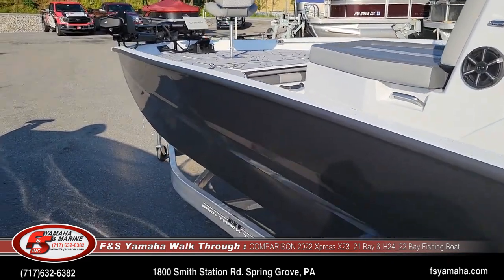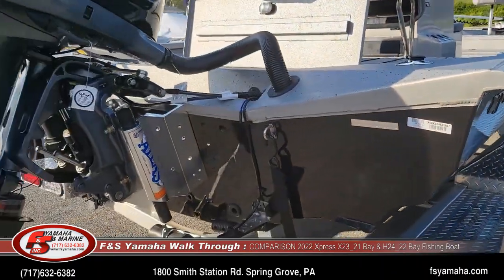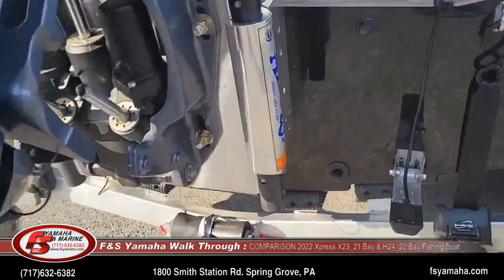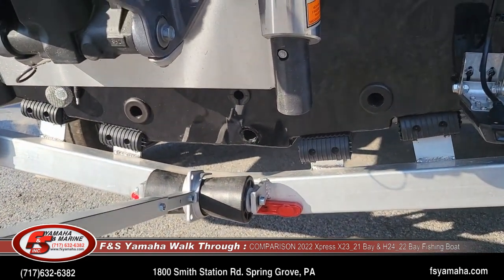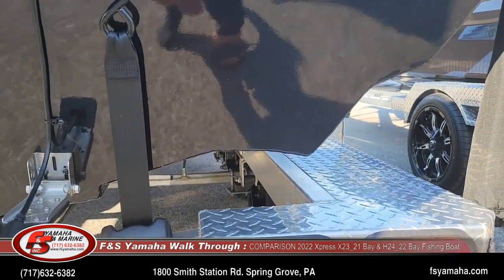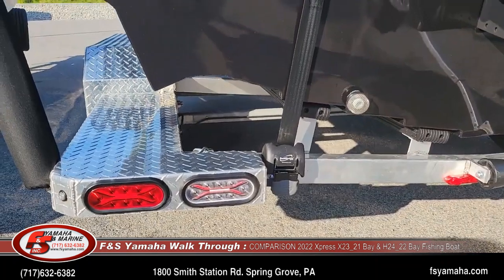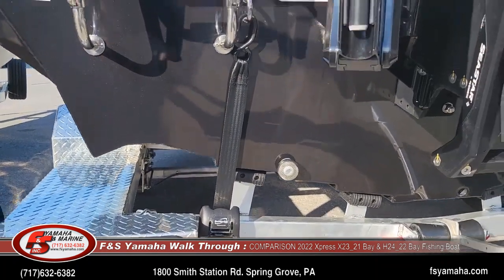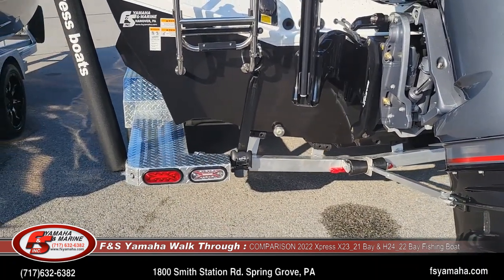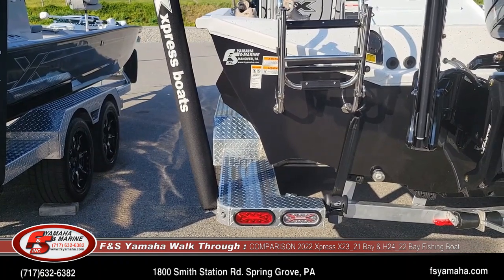Something else in the rear of both boats: they are both pad-hull boats. When the motor is running wide open and trimmed out, the only thing in the water is that roughly 15-inch-wide pad. Both have aggressive steps and an aggressive reverse chine. On the X-series, however, the reverse chine is considerably more aggressive, the steps are more aggressive, and the overall aggressiveness at the bottom of the hull is considerably different. Both will turn very sharply and will not skip across the water like so many aluminum boats do, but the X-series turns even more aggressively.